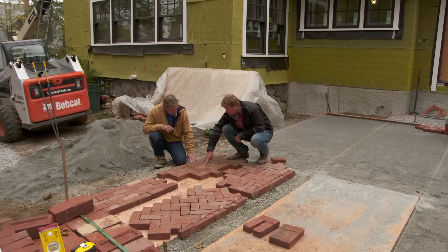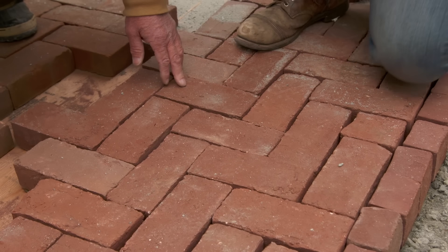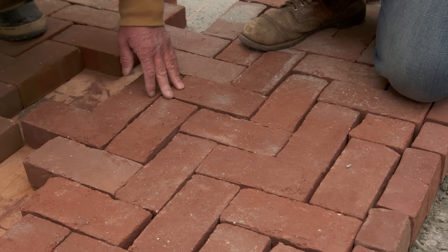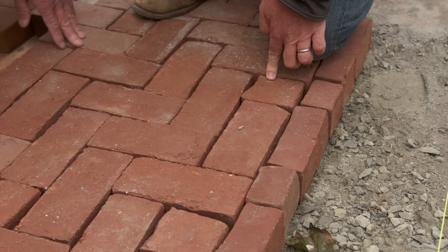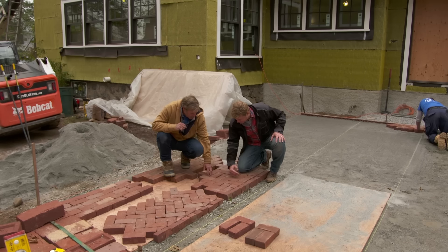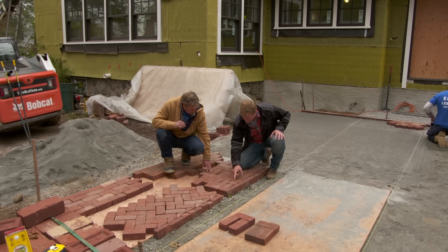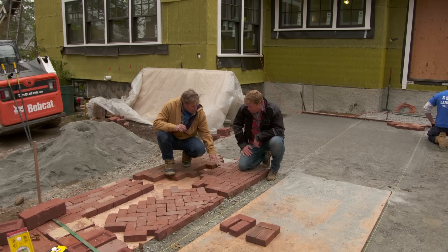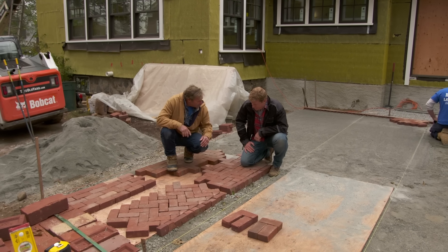But they don't want the modular — they want S&H in herringbone. Here's a classic herringbone pattern and you can see how you have some openings in the brick to make it stay on the herringbone pattern. The herringbone is defined by these things coming into each other at a 90-degree angle. So we've got some cuts to make and they may be irregular in size, so you're not gonna get the yield you would like from cutting a brick in half.